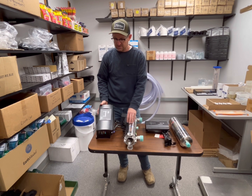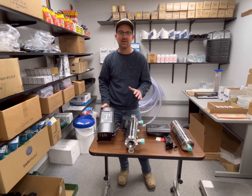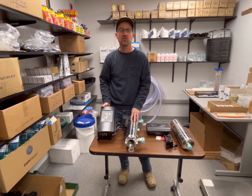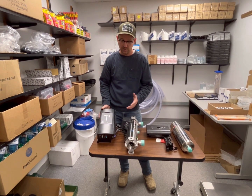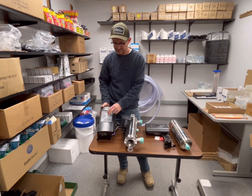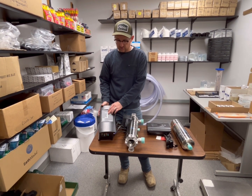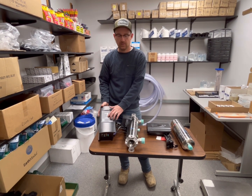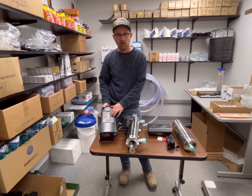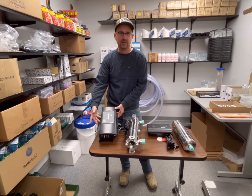This particular UV system also includes a flow sensor — we honestly hate these flow sensors, as they trigger nuisance alarms all the time and we often tell people to disable them. But if you're in an area that requires them, you do want to include it. The ballast monitors the health of the flow sensor and also includes the life of the lamp. In this particular case, it's a two-year lamp, so it will alarm after two years. At any point you can silence the alarm and reset the lamp life.